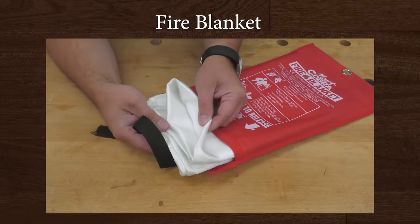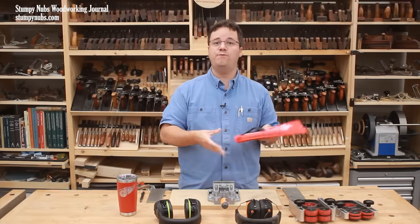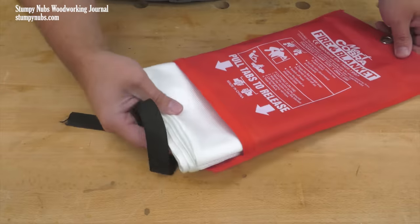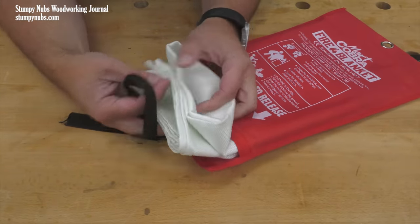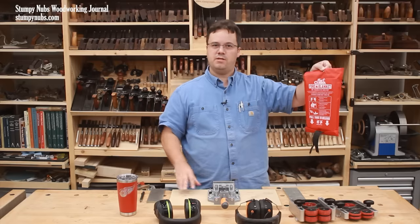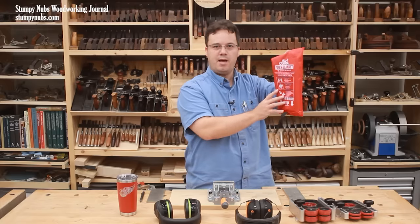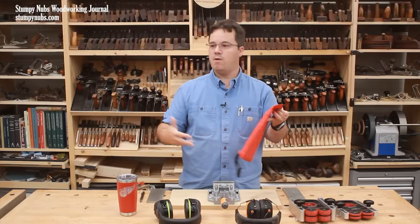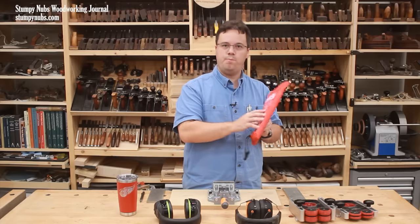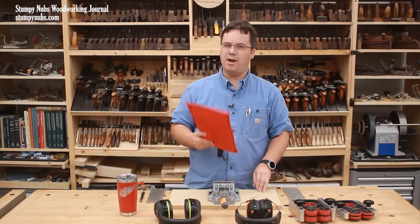Time for the biggest surprise in today's video. Do you have a fire extinguisher in your shop? I have one, but it's not my only line of defense. I also like fire blankets. They're inexpensive, they're fast to deploy, and they don't have an expiration date like a fire extinguisher. This one is 40 by 40 inches and it's made from a heavy material that will not burn or melt in temperatures up to 2,000 degrees. The way it works is simple. You hang it on a wall somewhere convenient. I like that because it doesn't get buried in a cabinet like some fire extinguishers do. It's easy to spot when you're freaking out because there's a fire in the shop. You grab the straps at the bottom and you pull. Then you simply smother the fire with the blanket. You starve it for oxygen and it goes out. It works on wood fires, grease fires, whatever. They come in a two pack, so my wife has one in the kitchen too. It's just peace of mind for about 10 bucks each. You can't beat that. I'll link to them below this video if you want to check them out. I really suggest you do.